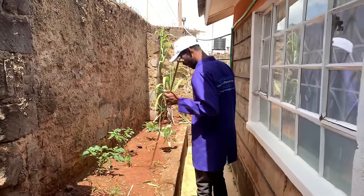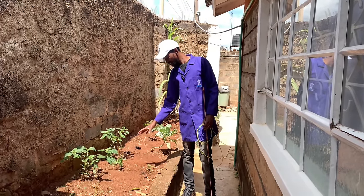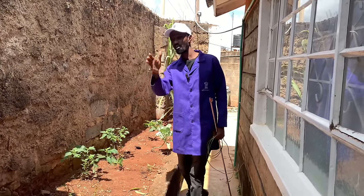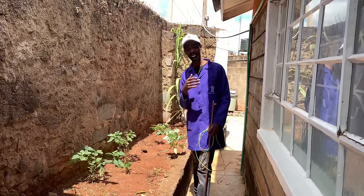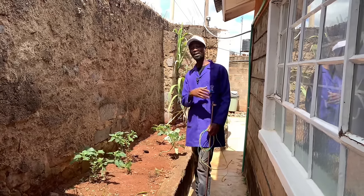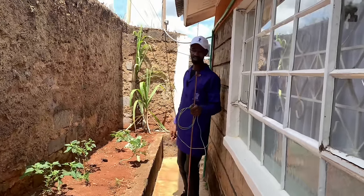Here we have this ground at a point with a lot of sunshine, meaning the ground is dry. If you compare this part where we have a lot of sunshine with that part over there which has a lot of shadow from the tree, there is a difference. Once rain falls on that shaded area, it automatically increases the conductivity of that soil compared to this sunny part here.